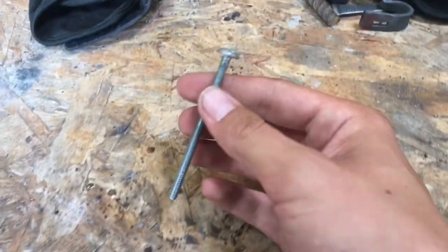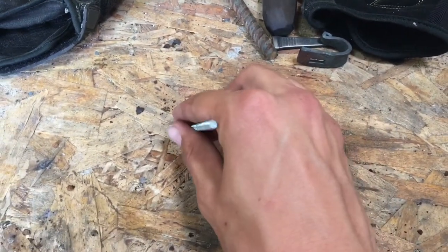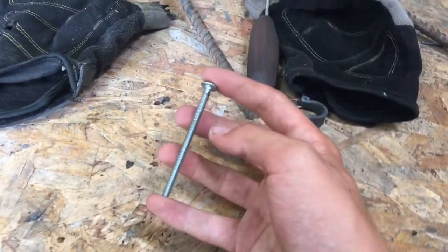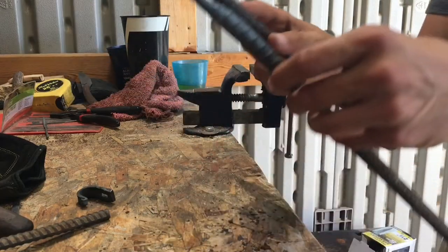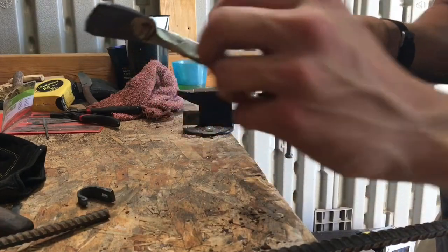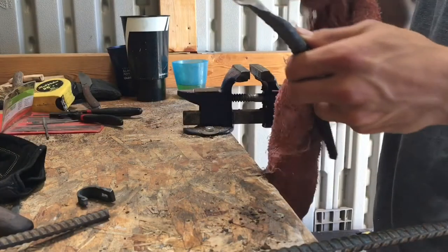When it comes to pinning material, I'll be using just a small bolt — about a quarter inch. Something slightly thicker could work too if you have it. This is just to show how you can use less expensive things to rivet instead of buying pin stock. I'm mostly focused on getting this to be a flat level surface that gets flush with the other side of the tongs. Then we center punch it. Even if you go with the drifting route for the hole, I would still recommend center punching — it really helps get accurate placement no matter what you're doing. Now we just got to clamp this up and drill the hole.